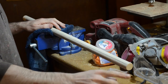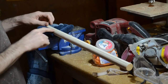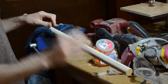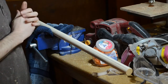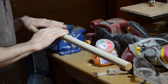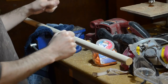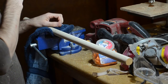I'm gonna go ahead and just bevel the part that I need, and I'll keep it cylindrical up here. I measured out the increments, put a piece of tape around it, took the tape off, measured out the lines, then put the tape back on so I could get these nice lines. I used the edge of a board to draw parallel lines going all the way around. To bevel it, I'll cinch it down in my bench vise and use a belt sander, running it over until I just barely hit the lines, then use a hand sander to get it finished off.